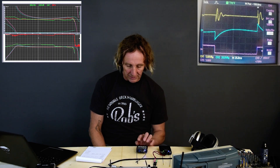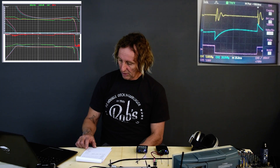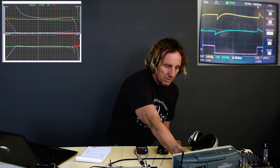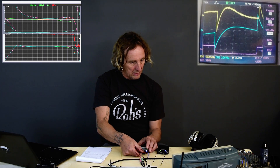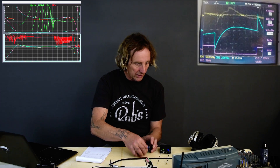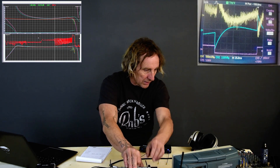I have them both set — Lectrosonics set as high as it'll get; I don't know if I have the Shure set as high as it goes, it might be able to get higher. There's the output of the Lectrosonics and the input to the Lectrosonics, and here's the Shure in the same scenario. We can see there is some noise on the Shure. We're seeing a much fuzzier line on the Lectrosonics, like we saw at the front panel as well — some digital or high frequency noise. The front panel on the Lectrosonics is actually very noisy and out of polarity as we noticed before.